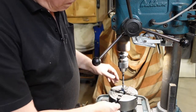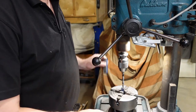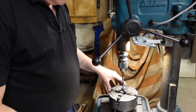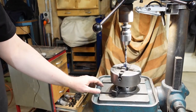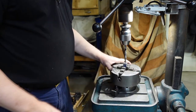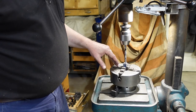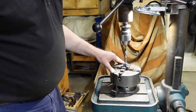I'm drilling this in my four-jaw chuck because that's an easy way to make sure it's square to the table in both directions. I started out balancing this only on three points on the pins from the D1-3 camlock chuck, but I felt it twitching a little bit. I've learned to listen to the little voice inside — down here is a camlock mount I made up for precisely this reason, so I'm holding it down there to keep it secure. I've ignored that little voice in the past and disaster has ensued, so these days when something suggests it isn't quite right I stop and think about it — it's a good habit.